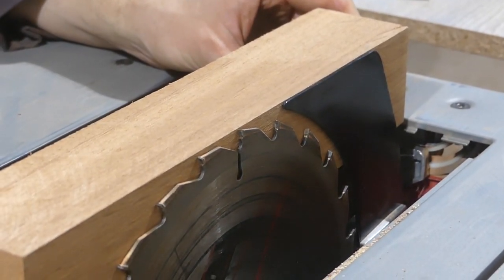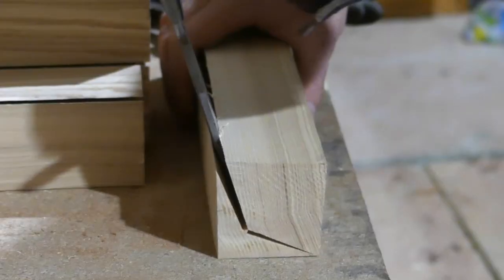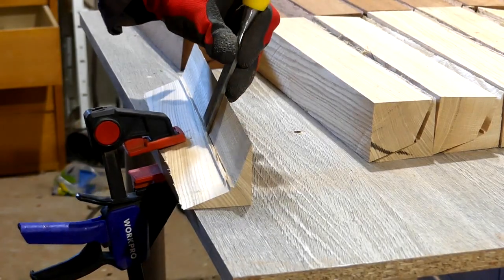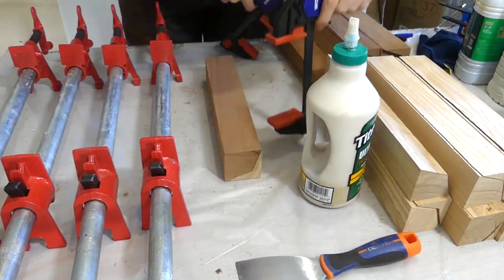So once that was changed, I traced a line through the squares and cut those strips down twice to get just the right intersection. It's better to not do enough than to do too much, so I finished them off with a chisel. That basically gave me identical parts for both the ash and the sapele, which I could switch between the two and glue together.